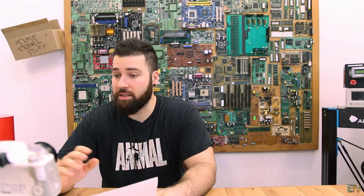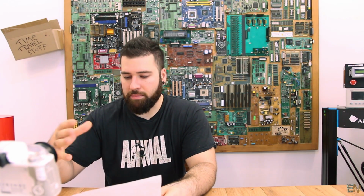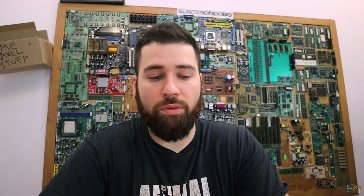So for sure you will need an op-amp or operational amplifier, because in any circuit you could use that. You use it to amplify, to compare signals, to follow signals. So you will also need comparators. You could use an op-amp to make a comparator, but it's better to use just a dedicated IC for that. It is called a comparator. So for sure you will need operational amplifiers, and in my case I have a bunch of LM324 that I use every day.